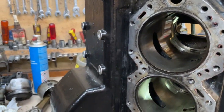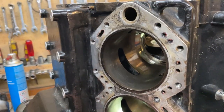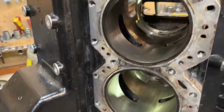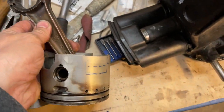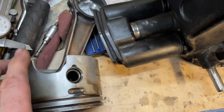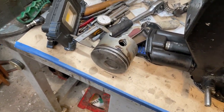I'm always told this is 150 horsepower. What I was told is that the exhaust porting is different between the 175 horse and 150 horse. These side sections here, of course, balance the piston from tipping over.